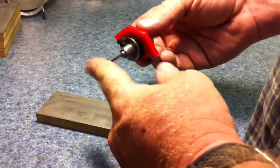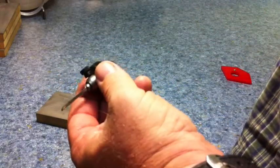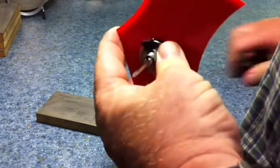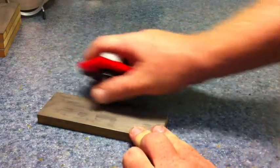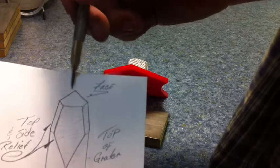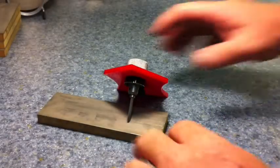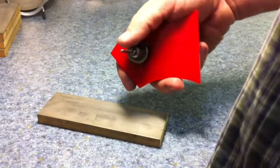Now the graver has its shape, but it won't have a face on it until you take it out of the small template. The graver is still in the arbor, so it hasn't lost its length. The next thing you do is your face — you grind and grind on that until it comes all the way to a point. It'll be flat until you get it ground back far enough to expose the tip made by grinding the bottom. Keep grinding until it comes to a sharp point, and you're done with your face once you reach whatever grit you want for the finish you're cutting.